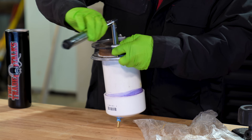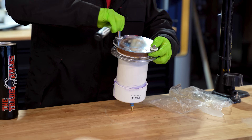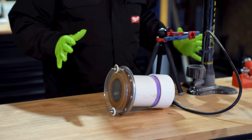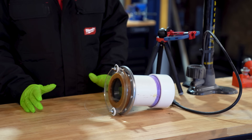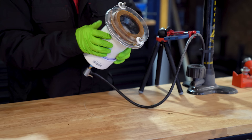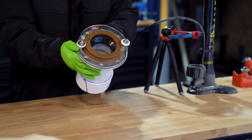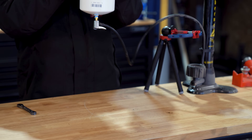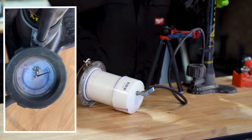We've got these started just like you would have on a toilet. Now we're going to snug it up just a little bit. We really don't know how much pressure is on it because this isn't like a toilet — the toilet's got a flange where it's going to sit around the outside. As you can see, we've squeezed it down until the wax has started to push out around the edges. We can see about how far down we are, and we're tight enough that it's pulling up on the sides.